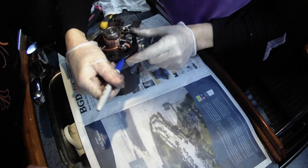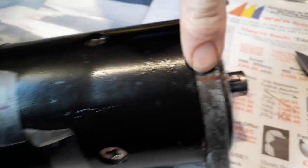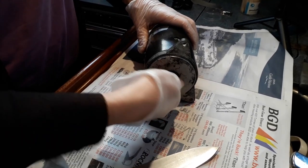I've just put it back together again. I stuck tape and drew lines on it so I knew exactly where the screws pass through the armatures to meet the front plate. I also marked the front plate so all the screws line up on the lines I made with a sharpie. Otherwise, because they're all on the inside, when putting it together from the outside you've got no idea where anything is. By marking them all before assembly, the screws just literally slid through. I used the old technique of backing the screw until I heard a click — then I knew it was on the thread and screwed it in properly. It rotates freely now. We did price up replacement brushes — the only way we'll know if this worked is to reinstall it.